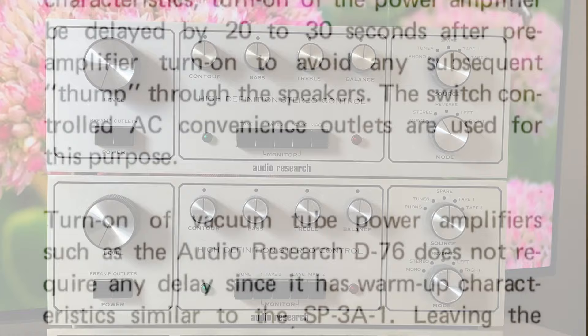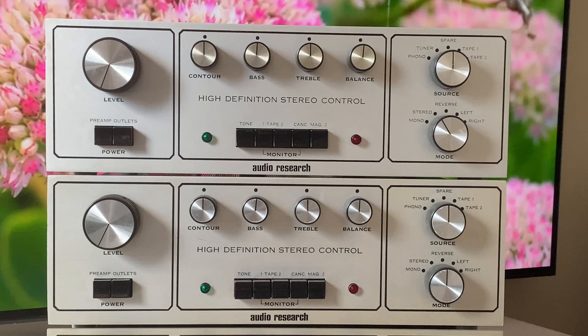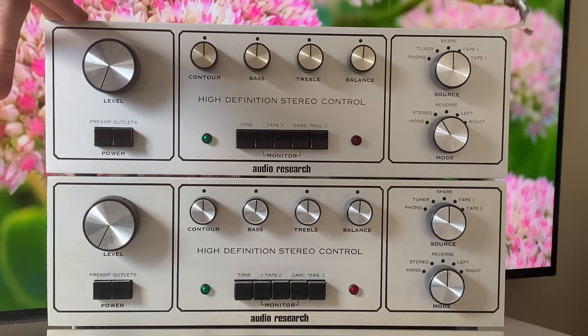When powering off, turn off your amp first, then turn off the preamp to avoid any spike. With tube amplifiers you don't really need to worry as much, because the tubes need time to warm up and all the weird stuff that happens at turn-on will occur well before the amplifier can start putting out audio. We'll go through some demonstrations on that.